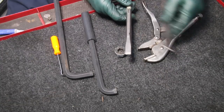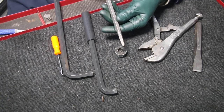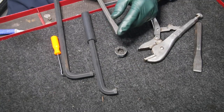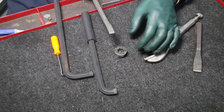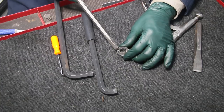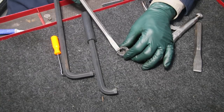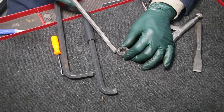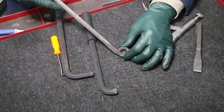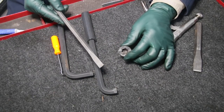The trick is to get a chisel. I've got a couple of different chisels — this one here is my favorite for removing these type of plugs and large screws that just won't budge with a wrench. You have to make sure it's very sharp — sharpen it at an angle. Use the chisel to come in right on the edge and hammer it so it rotates in a counterclockwise rotation. Keep hammering until you get it to take a bite. That's what I did on this one — I drove it in, kept rotating it, until I got to that position and gave it a big whack to loosen the plug.